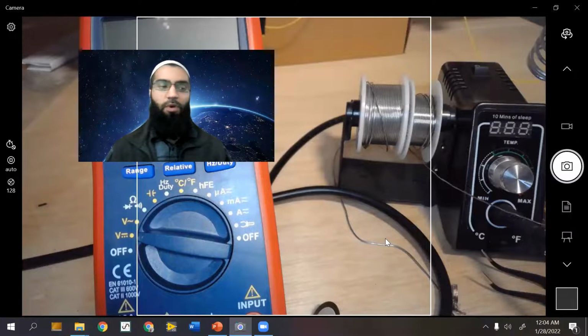A ceramic I had laying around. But if you wanted to use another, like a piezo ring, or another type of rectangular element, sometimes you dice it and you're not sure which side is which anymore. Well, you can do this heating test in order to determine which side the poling direction is on by applying a little bit of heat. Not directly, but a hot air gun also works, a soldering iron, you can even use a hair dryer. You can also blow on it, I've tried that, it works, but it also creates some other problems in terms of heating and cooling, depending on how hot your breath is.